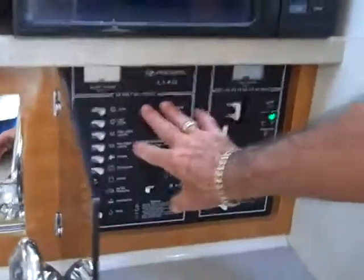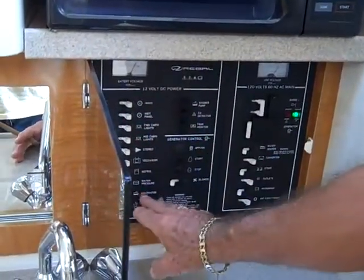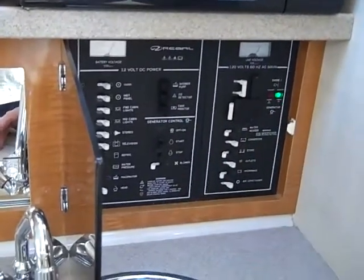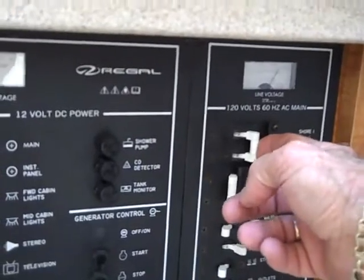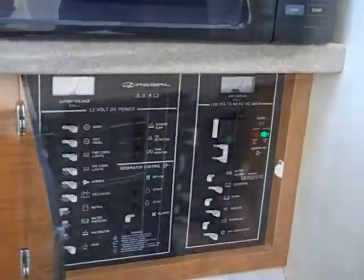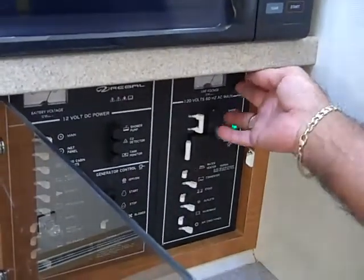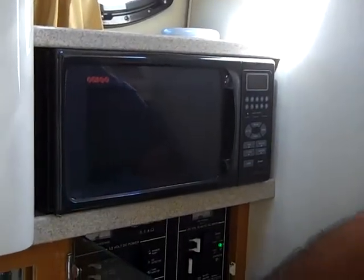Let's look at your main panel. On the left side is all the DC voltage; on the right side is all the AC voltage. Your instrument panel — all these are self-explanatory. I've actually taken the panel off and made sure everything is fine behind it. You have your generator start right here. On the AC panel, these are your main breakers. This is your shore power — you turn that off, throw that switch up. You can't have shore power and generator on at the same time, then you throw your generator panel on. On the left is DC — battery-operated components; on the right is 110V AC components.